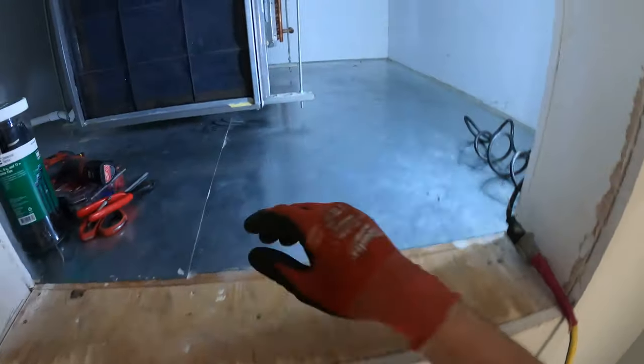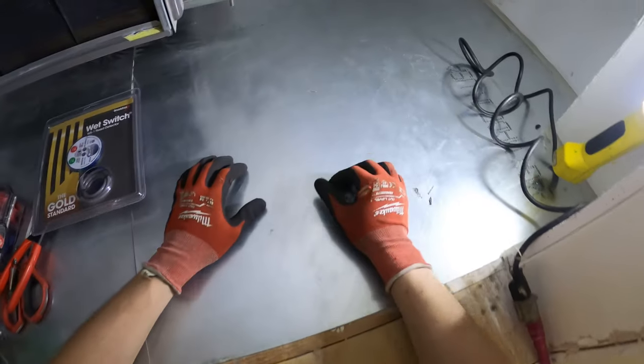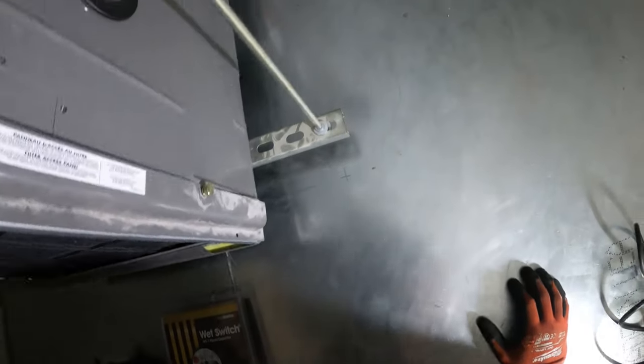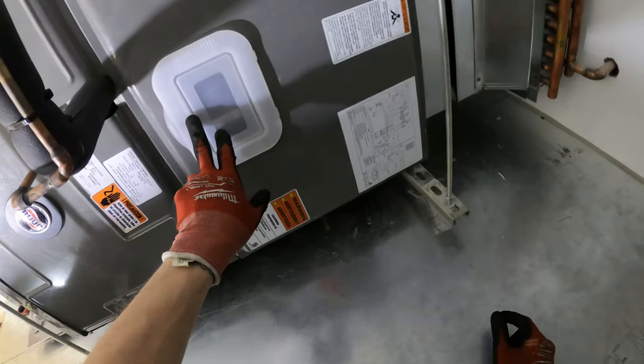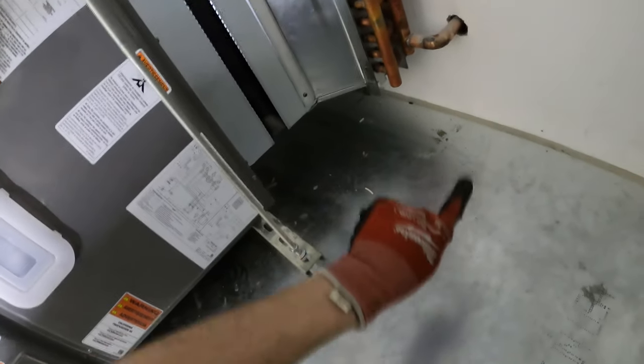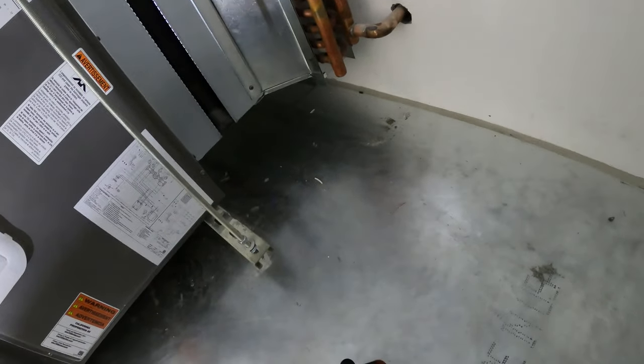So that was the condensing unit up on the roof. And here is our indoor air handler. This is a split system with emergency electric heat, and they use their primary heat from a hot water coil, which is tied to a boiler that is downstairs in the basement.